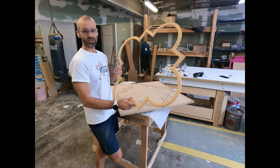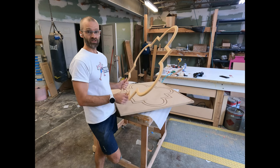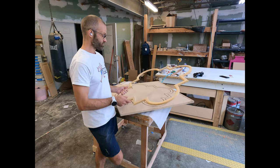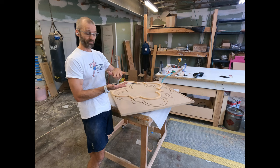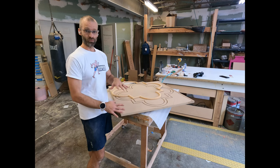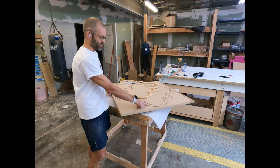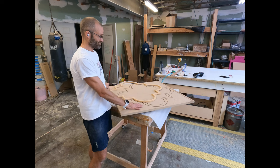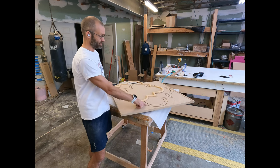Here we have other complex shapes — this is actually for a mirror. It was about a three-foot by three-foot mirror. I literally took a piece of three-quarter inch MDF, put it on top of that mirror, double-stuck it down, turned it over, and actually ran the mirror on my pin router to create this pattern. I was able to take that shape off an existing part, recreate it onto my tool, and now I can create this pattern anytime I want because I have this tool.